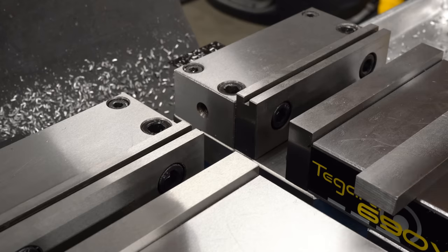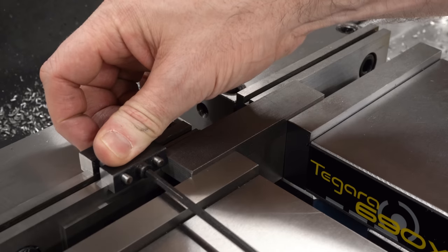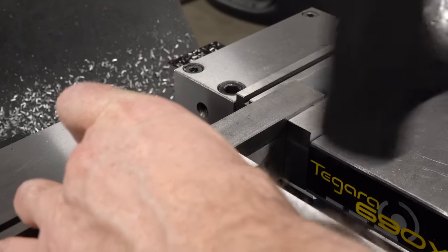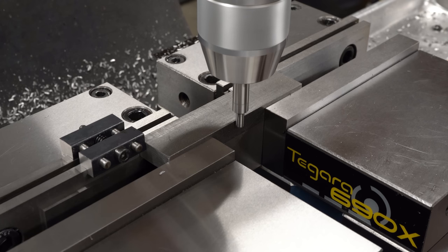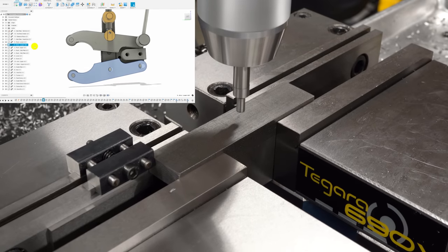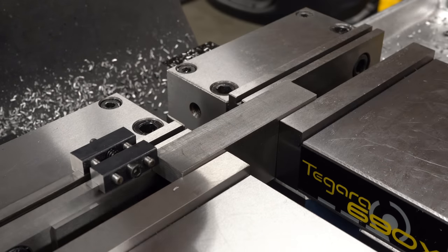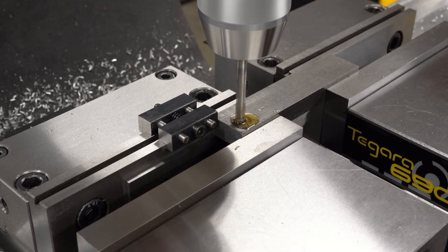Next up are the arms. I'll grab the stock from the kit and set up between the two vices. Since I have two of these, I'll set up a stop and get them on parallels - holding the parallels to the left because there is a hole in the upper right corner that would hit them when I drill. I'll use an edge finder on all four sides to establish a datum in the center of the part. These parts are too long and will get trimmed to length when we round the corners on the ends.